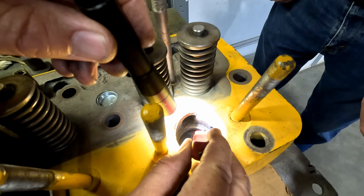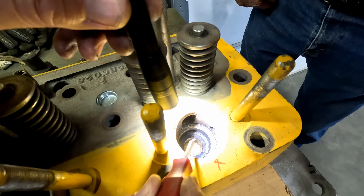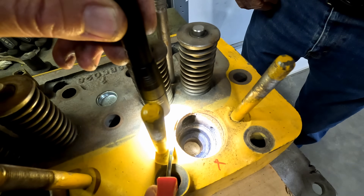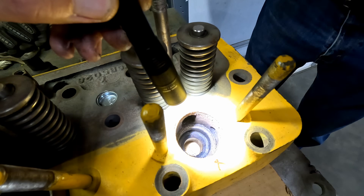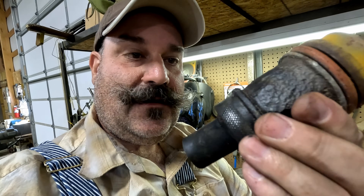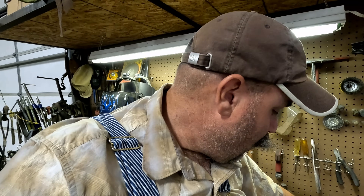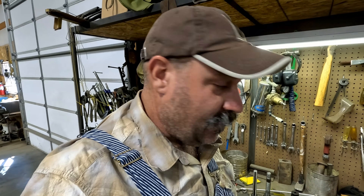So there's a copper ring right here that you'll have to get out — I've got you the part number for that. There should be an arrow right here, and that'll line up with the arrow on your pre-combustion chamber. The center line of these bolts is good too — as long as you get the angle right where they go in. We noticed some interesting things: this one has knurling on the bottom, and the gentleman here suspects that's to keep it from wobbling around in there. I have the one from 1938 from the RD4, and it doesn't have that — so it's something they updated. We're gonna pull number one out to see what it looks like. Number four — I think they're gonna manage to save that one.